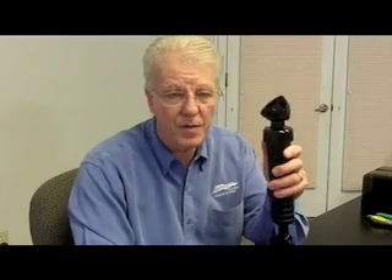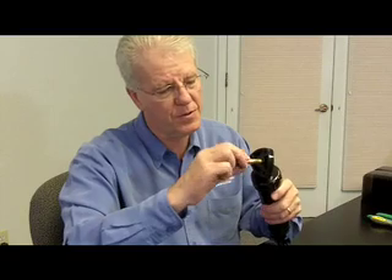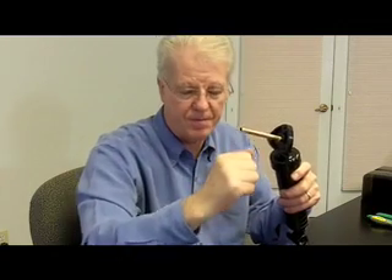On a new installation, if you find that one hydraulic cylinder is running a little slower than the other one, you may have inadvertently screwed in the 3 inch brass pipe nipple too far. The instructions tell us to run it in hand tight and then two more full turns with a vice grip.